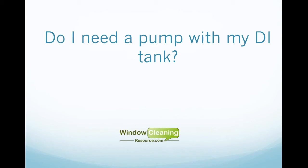Okay, next question. Do I need a pump with my DI tank? No, you do not. You do not need a pump with a DI tank because a DI tank is not a restrictor filter. The way it works is it is a catch filter. So it catches the minerals as the water passes through, so it does not restrict the water flow. When you connect to the spigot, that water is not going to be restricted at all. So you don't need a pump for a deionization system.